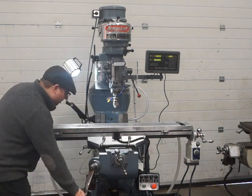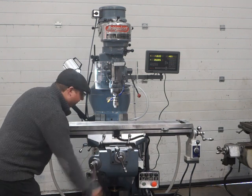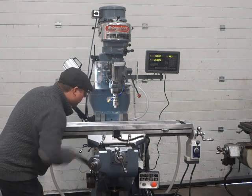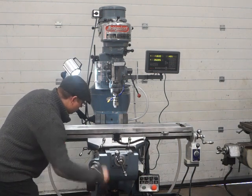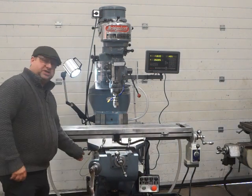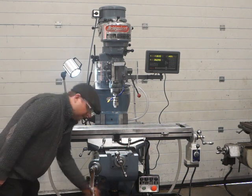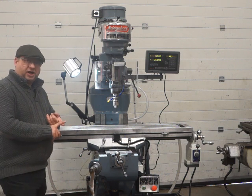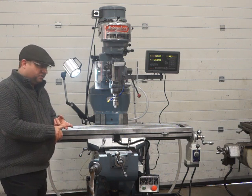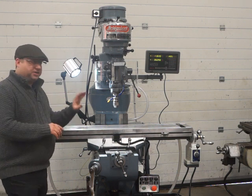That's all nice. Same with the knee — this is all in service, so that's all running really good. All the locks have been serviced, they're all working great. The knee lock as well down there is working good. The lube's all in service, so you've got brand new pipes, brand new oil distribution valves. All the lube pumps have been serviced, that's all been checked and it's working great.